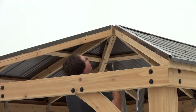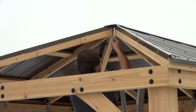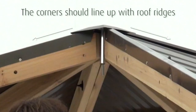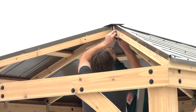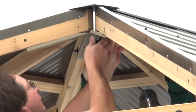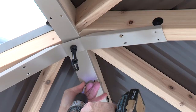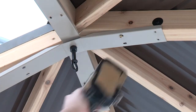Using a tall ladder inside the gazebo, place the roof peak assembly into the gap at the top of the three roof panels. Make sure the corners of the peak cap line up with the roof ridges. Next, push the two roof peak brackets onto the carriage bolt before attaching the peak loop with just a few twists. Use pan screws to secure the roof peak brackets to each corner LT and corner RT.